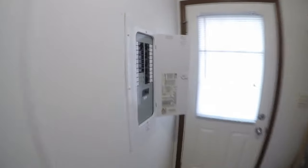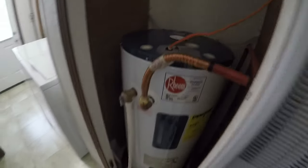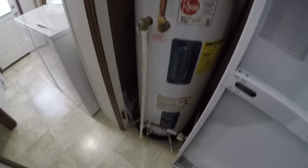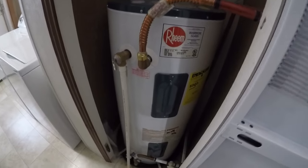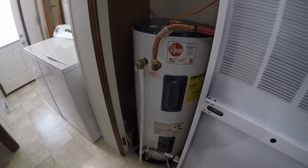The very last thing you want to do is power it on — go back and turn the breaker on to the water heater. That will take about 60 to 80 minutes for this thing to heat the water up. What you don't want to do is turn the breaker on first — you want to wait till last to turn the breaker on, so you don't burn up any elements or do any damage.